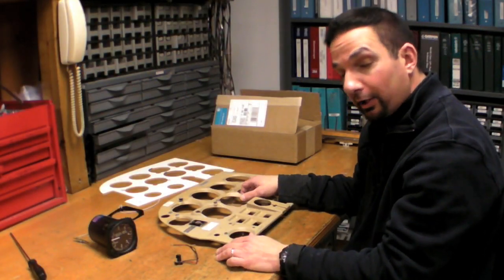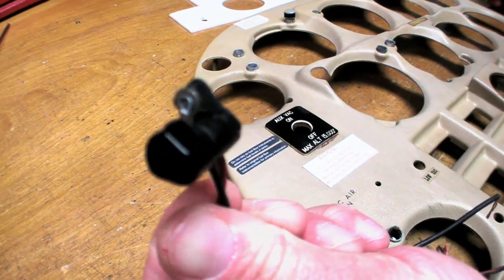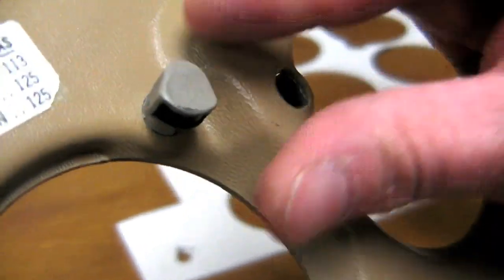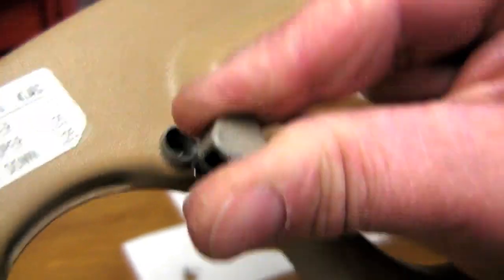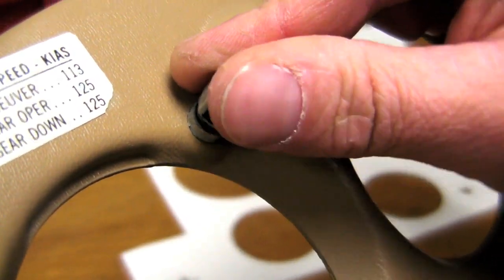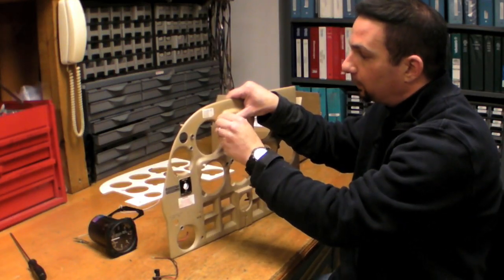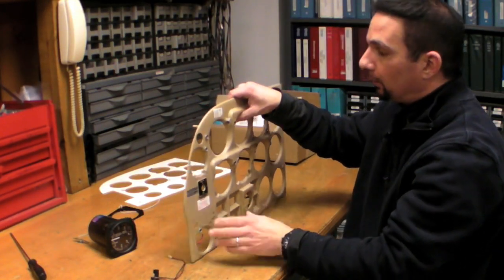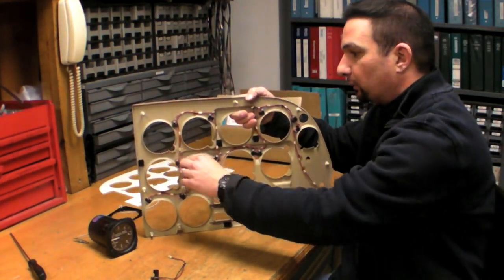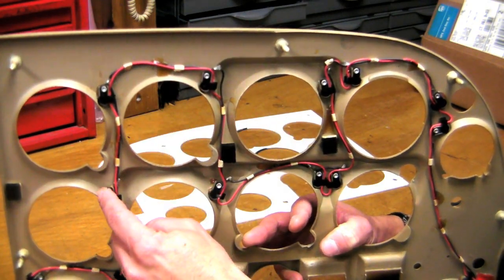Here we are on the avionics test bench, and we've got a post lamp — one of the more popular ways of lighting an instrument panel. These post lamps simply snap into a socket that's part of an old and more likely brittle overlay. When they snap into place, they generally don't make good contact — sometimes they do, sometimes they don't. It's either hit or miss. The real problem is the wiring that lives behind this plastic overlay, which is generally old and brittle and can be a huge source of intermittency.